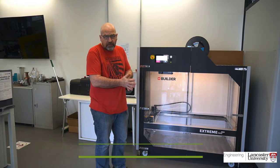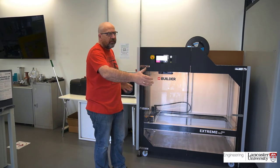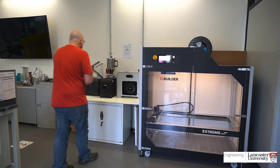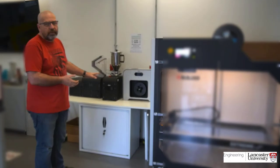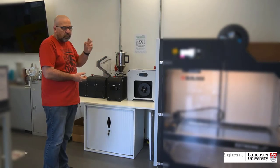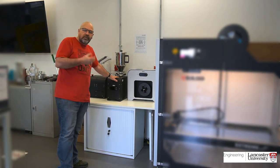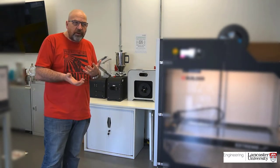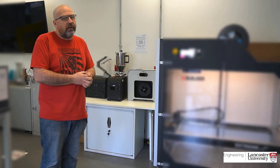This is our Builder 1500 — very similar to the 2000, but a slightly different aspect ratio. It has a build bed of 1100 by 500 millimetres, with a build height of 820mm tall. We've also got our suite of reprocessing equipment from a company called 3D Evo. We've got the polymer shredder to reprocess failed prints and support material. Then we've got the pellet dryer to dry those pellets, and then we can feed them into this machine to extrude our own filament. So, not just reprocessing of existing materials, but we can also start playing around with new materials and putting additives in to make our own specialist filament.